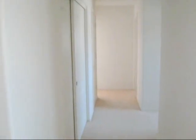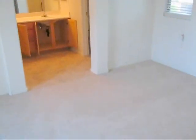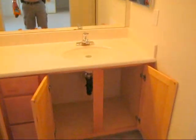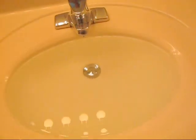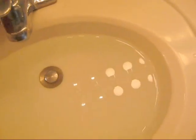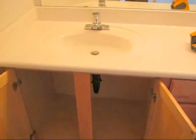As we inspect the home, we work our way through it, checking all of the electrical, making sure the AC is going, and checking all the plumbing. With a two-story home, I like to start upstairs first. I will get the water running in the sinks, the showers, the tubs, and fill the sinks to the top, then drain them.